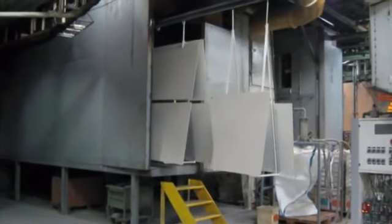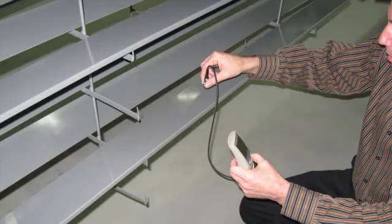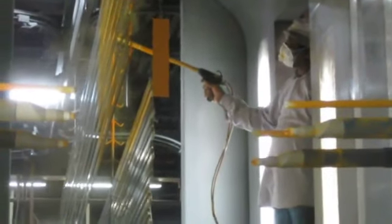Coatings must be applied within minimum and maximum dry thickness specifications, but waiting until after cure to measure thickness can result in product waste and production delays. The best point in the process to measure powder thickness is immediately after application.